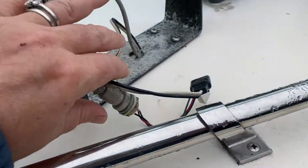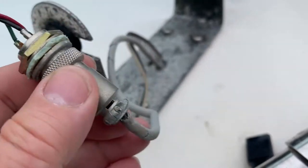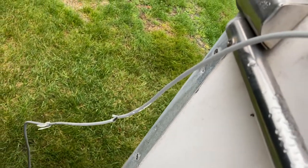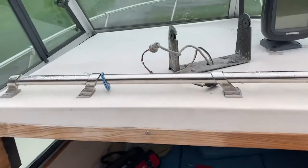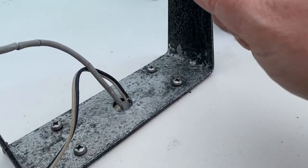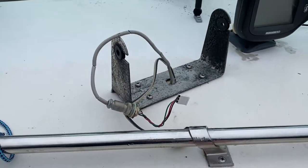Here's another example of real quality wiring work. This goes to nothing other than this completely rotted out transducer wire going to another completely rotted out transducer wire in the stern of the boat. Back here, look at this thing. That's a mess, but I may be able to use it as a lead wire. So I'm leaving it for now until I'm ready to run the new transducer wire. I probably won't bring it up through the same hole, but if I can get it up to the hull using a fish tape or something, then this may help me do that run.